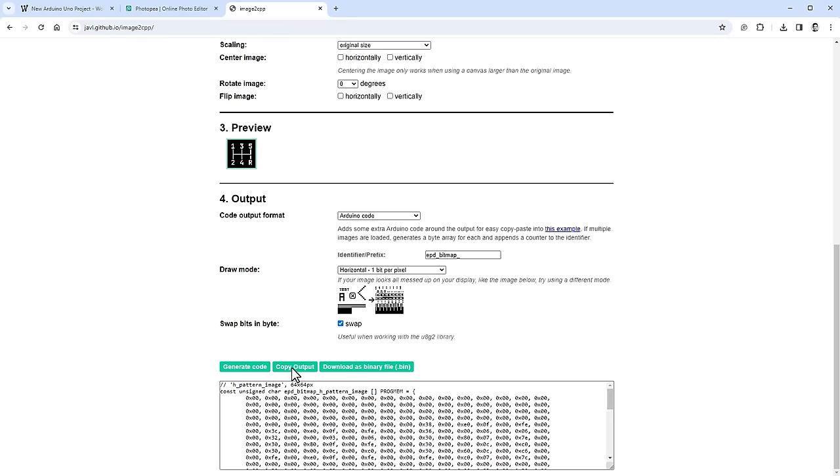I restart the simulation with all potentiometers near zero — showing neutral. Increasing top-left shows 1st gear; increasing both top sensors shows 3rd gear; only top-right shows 5th gear. Bottom-left gives 2nd gear; both bottom sensors gives 4th gear. I spot a bug — conditions for 1 and 2 were swapped — and fix it. After correction, 4th gear displays correctly, and bottom-right correctly shows reverse.